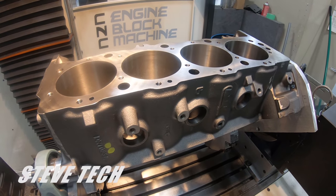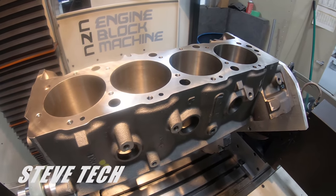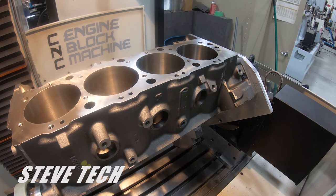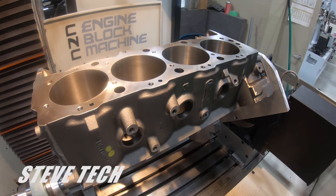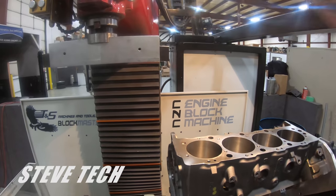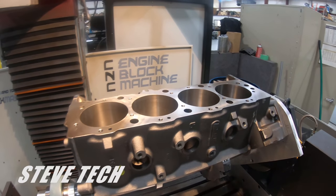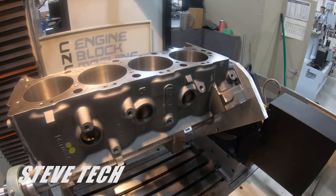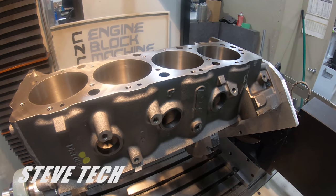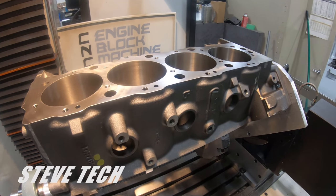The RA of the surface finish — I kind of forget the exact number, but I believe it's somewhere in the neighborhood of 10 to 15, right around there. There are no gaskets any longer that need a rough surface finish. Multi-layer steel gaskets or even copper gaskets — we make those things as smooth as possible. We use a large cutter with either a CBN or PCD insert depending on the material, which leaves an extremely nice, fine, flat finish. Everything needs to be resurfaced — stock blocks and aftermarket race blocks alike.